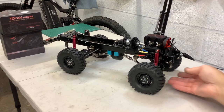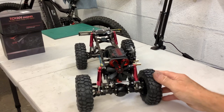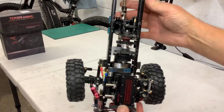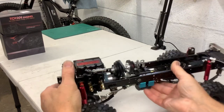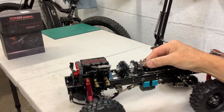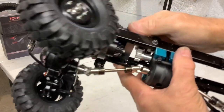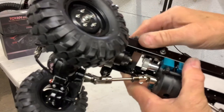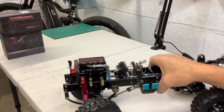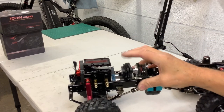It's taken quite a while to get to this stage. As you can see, we've got everything between the rails. This is the two-speed, which I'm running here — comes off the clutch bell at the bottom. I think I've got an 18 and a 23 on there, and I think I've got a 37 and a 40 on the spurs for the two-speed.